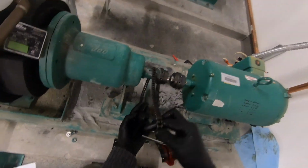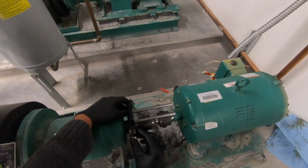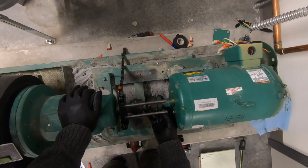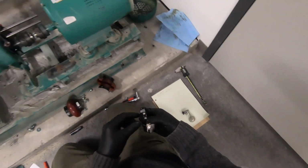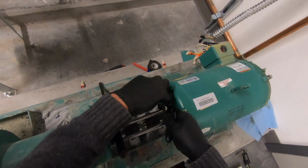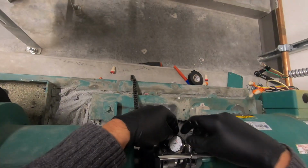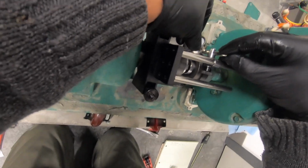And the idea is that one side of the tool fits on the pump side of this shaft. It's what's fixed. And what we're going to do here is put on a couple calibrated dials along these rods that will touch the collet of the electric motor's shaft. And it's really just marking its position in three-dimensional space. So we got one that's measuring in the, I'd say, X direction, and then another that's measuring in a little bit more of the YZ direction. And that was actually just because of the constraint of the space that we had on hand.